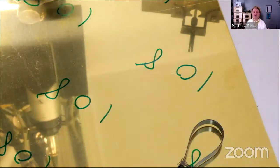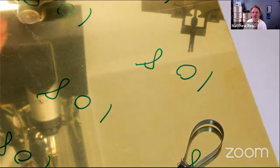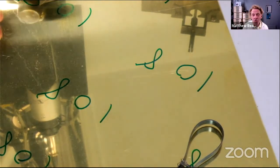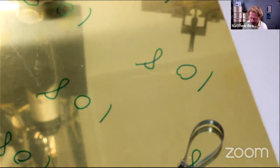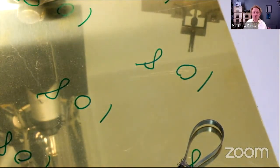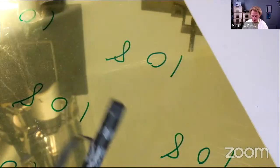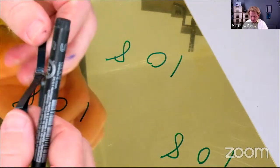CZ108. We're using CZ108 because we're going to fold this material and we don't want it to break. CZ108, which has no lead in it, I don't think, has really good cold working properties. But you'd get nowt for out, or out for nowt, as they say, and it's also quite sticky to machine, work, or file in our case. So, got another tool coming up, so it's an exciting day for that.